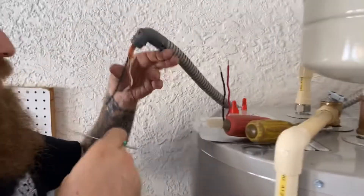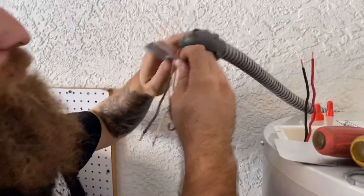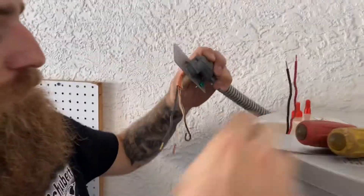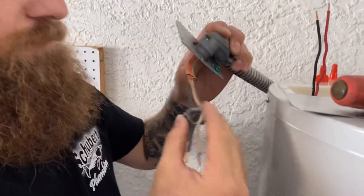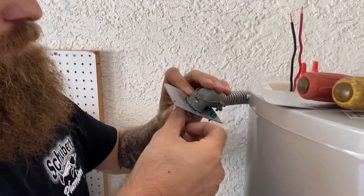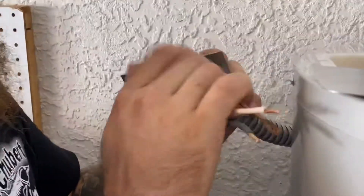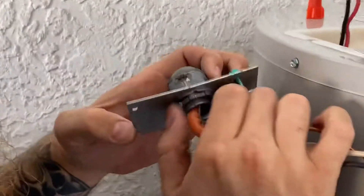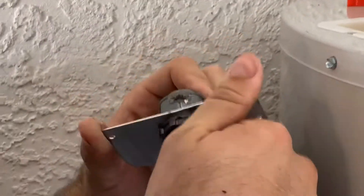Where are your wires? So you've got your wires here. Make sure your breaker is off, obviously — don't want to electrocute yourself. Slide the plate up the wires, then slide the nut up the wires. Spin the nut onto the threads under the plate.